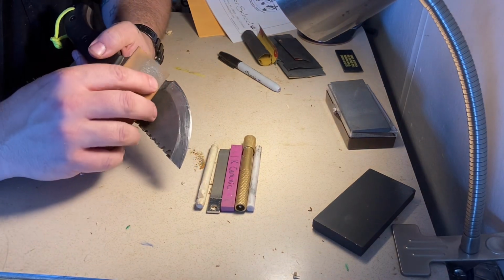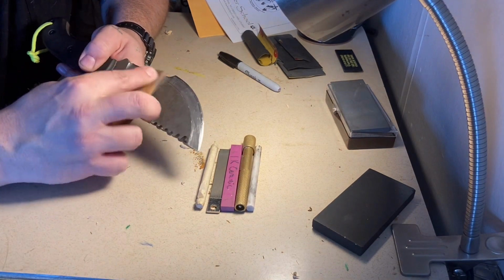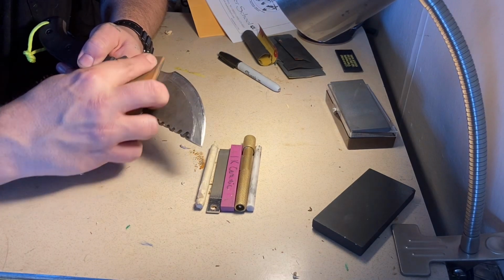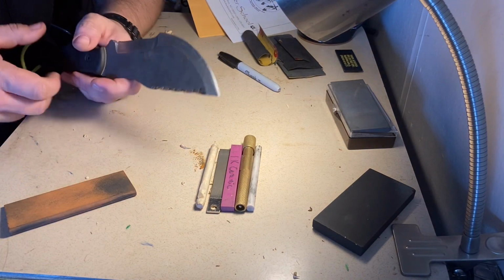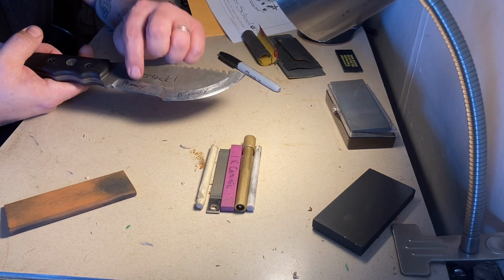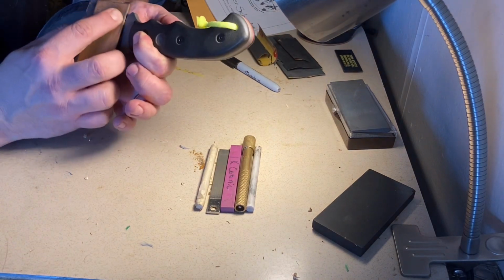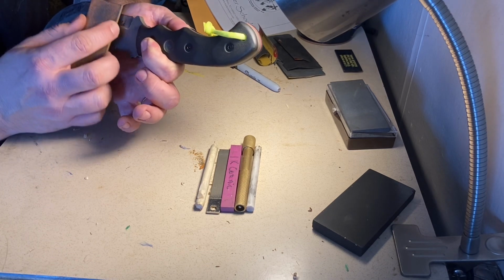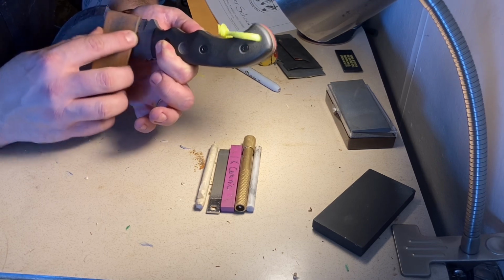Same thing down here. We just got done sharpening this. And then I would take my stone and just clean up them shoulders a little bit. That's going to give it a much easier time sharpening and not getting a super thick edge. If this thing was sharpened a lot, I could be all the way back up into here, and that's really thick steel. So while you're working on it, this is just something I do to set me up so that another 5 or 10 years from now I don't have a super thick knife. It's already thick enough, doesn't need to get no thicker.